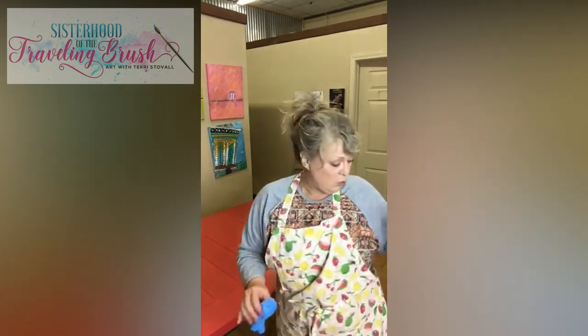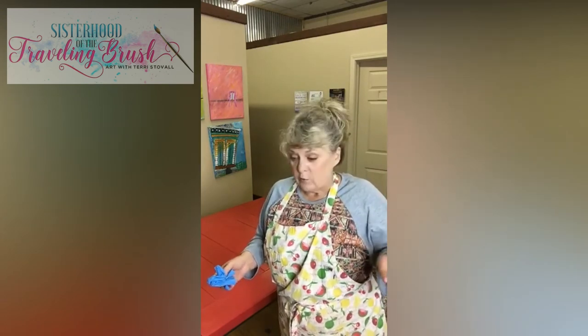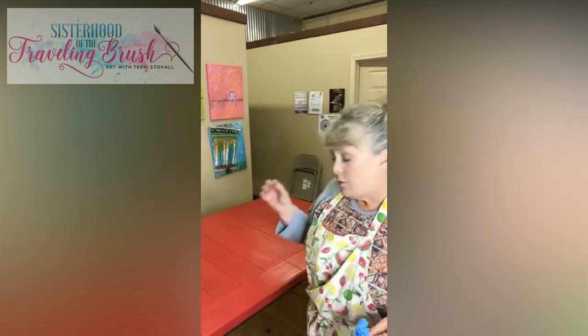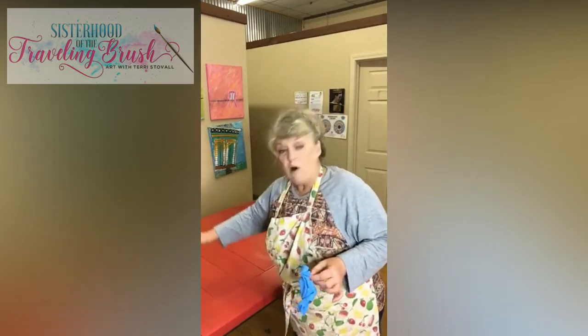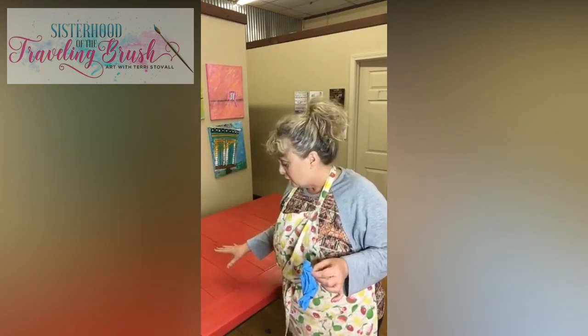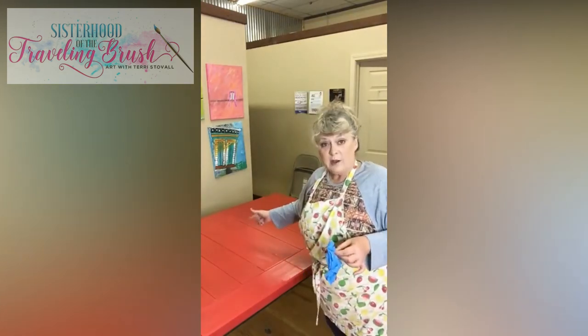I could create that glaze with Gator Hide or with Big Top — the DIY product. I have the liquid patina here in a small container and would mix a little bit of black paint in with that, then use it to get into the crevices, go over the whole thing, and wipe some of it back off. This will have to be completely dry first. I'll probably go that route because I'd be mad at myself if I messed something up because I was in too big of a hurry to use the wax — I can always come back and add wax to darken up areas after we do the stencil. Thank y'all for watching. Whatever I decide to do next, I'll come in and share the tips and techniques. I hope you'll share your pictures and progress with us!